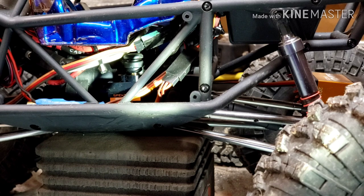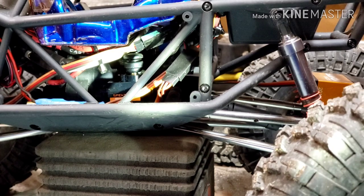The trick is to note which direction the servo goes every time you throw that button. Hit the button and note which way it's going. For mine, I made sure it went all the way forward — I had it set at about 25% and confirmed which way the servo turned, which was all the way forward. At this point, put your servo saver on. Push the dig rod all the way forward and insert that servo arm into the dig arm and on top of the servo. Make sure the splines are lined up — even at 25%, pull the dig arm back just a hair to make sure everything lines up. Then tighten your servo saver down. Now you can increase that percentage until it gets fully activated. You'll know it's fully activated when that servo saver kicks up a little bit.